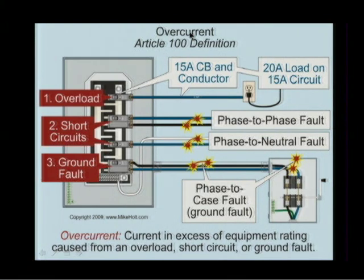Now, the National Electrical Code says how you can size the overload protection devices. Then they get into temperature rise and service factor, and you've got to go to the motor nameplate, and there's code rules that tell you how to handle all that. But we're going to put that all aside because in reality, you're going to be sizing the overloads by simply looking at the motor nameplate.